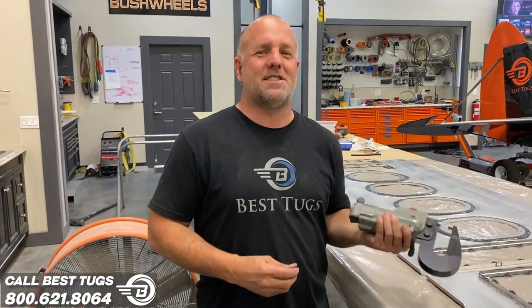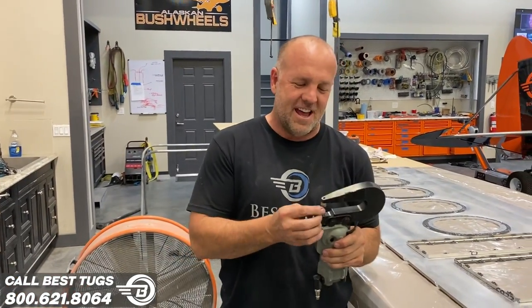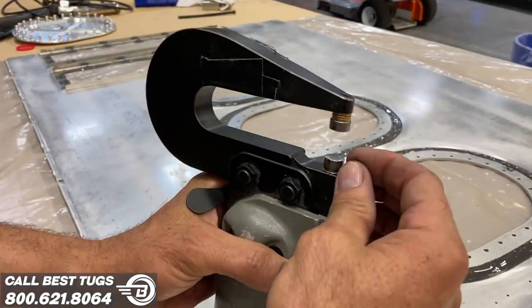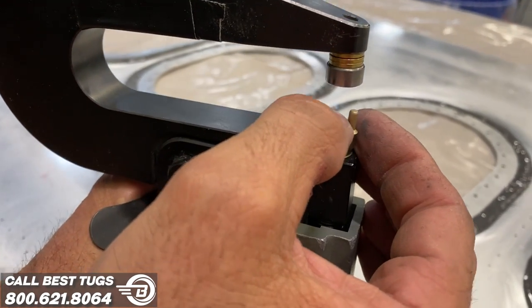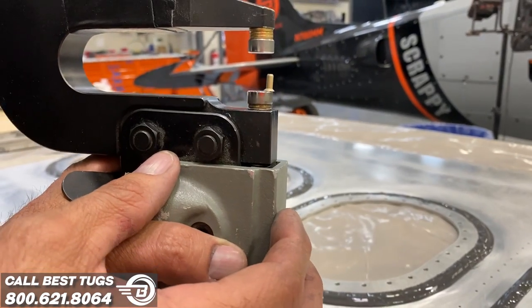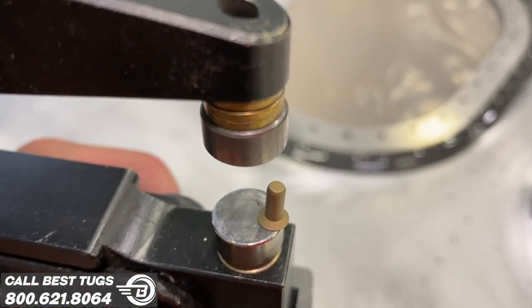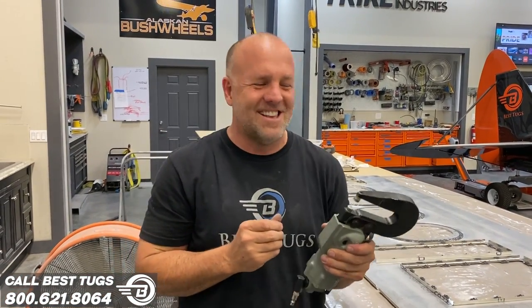All right, since someone's gonna ask what a smiley face rivet is, if you've been doing rivets for as many years as I have, we've all done a bunch of them. Essentially, this is the tool that squeezes together. If this little rivet head, as I was doing it, wasn't centered in here and it offset to one edge because you flinched, it would make a little half circle in the head of the rivet or pinch half of this off. It looks like a smiley face, but it's a sad face because it means you gotta drill it out and put in a new one.